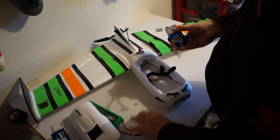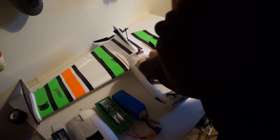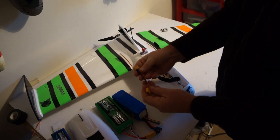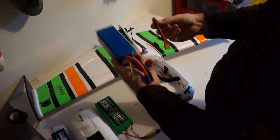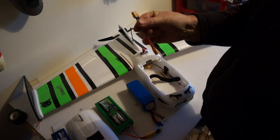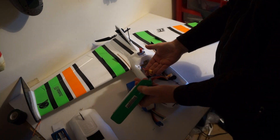You may have spotted I've got different battery connectors on there. Simple fix: coming off the flight controller I make up a little short pigtail, so I can just swap that out for one with an EC5 on it if I want to run those batteries, rather than chopping off wires and soldering on new plugs. Simple little mod for running different battery connector types — then I can go back to XT60 plugs just as easily.